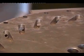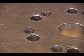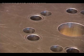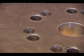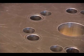Going toward the center of the rotor, you'll notice holes drilled in. This particular motor has 12 holes. These are 20-degree offsets to allow the rotors to be offset 20 degrees from each other, allowing the motor to run. If they were all parallel, the motor would not run.